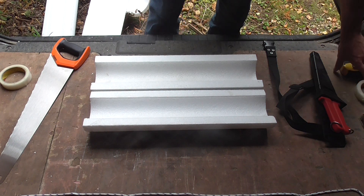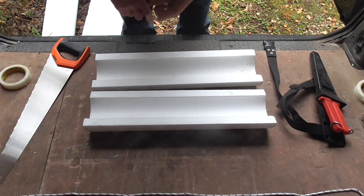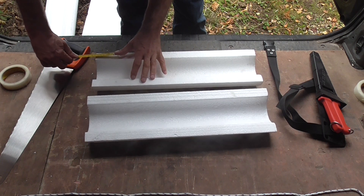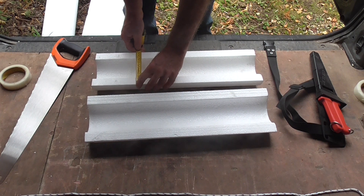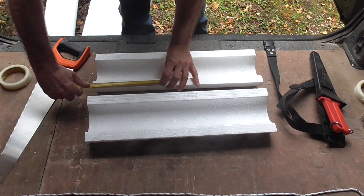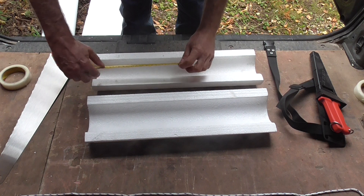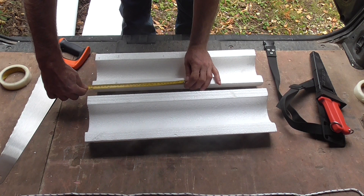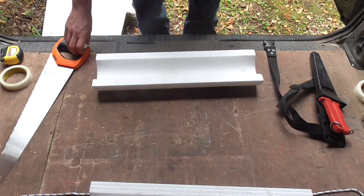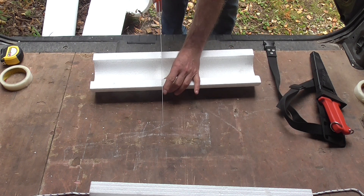Right, so let's get started. First of all we need to construct a T, and to do that we need a diameter. So if we take 75mm and put 75mm on the end, and we take the diameter of the section — just measure across it — which is 150mm, so we put in 150mm, and again 75mm on the end of that. Now we cut across there, marking our diameter.